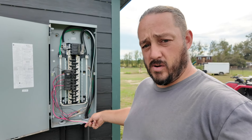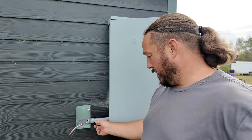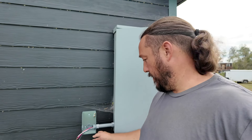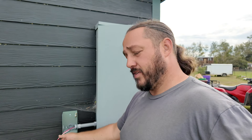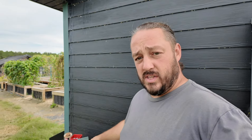So we've got our wires run through into the mounted box right here. It probably would be a little bit better — they make a flex line that can connect up to this with a little give in it. I guess I didn't realize how far offset this box was going to make things. It's not unsafe or anything; it's just when I screwed this box down it's kind of at an angle. I'm going to leave it because I don't want to have to undo it and fix it — there's no functional disadvantage, it's just maybe a little aesthetically off. So next I'm going to go ahead and wire these into the back of the switch right here.